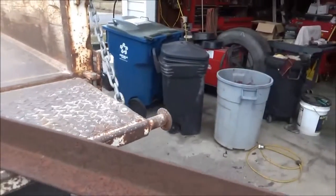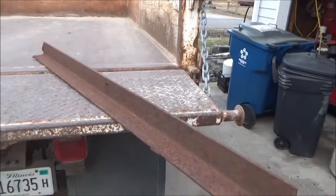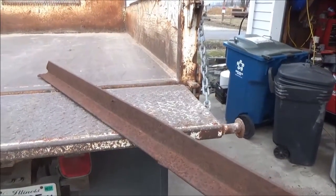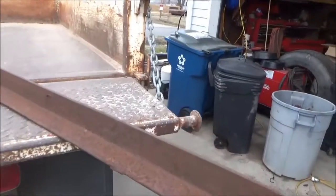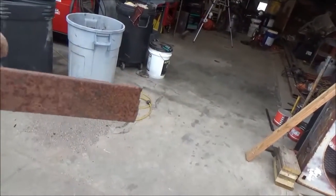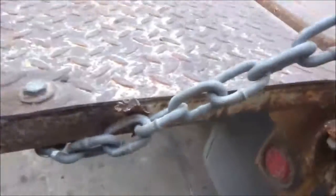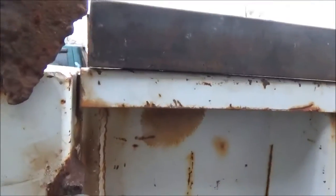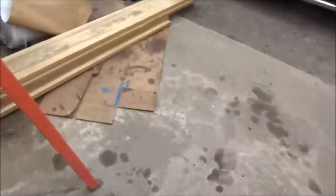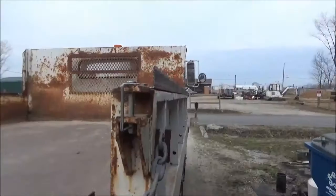Getting back on this. The next day I had to stop and leave and use the truck for something else yesterday afternoon. Now I've got a piece of quarter inch by two by two and a half out of my scrap pile. This end is rotten over here, so I'm going to cut that off square and then weld it on up here. The boards that are going on are 11 inches, so I've got to make two pieces, one for each side.